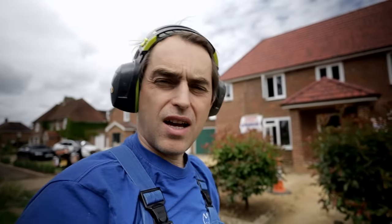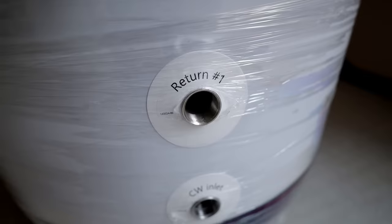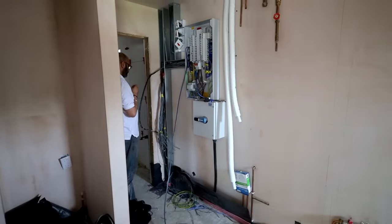We are back to Windsor today — another week and a half later — and the screed is done. We are ready to put the cylinder and heat pump in, however unfortunately we can't do that for two reasons: the cylinder return connection is cross-threaded, so this has to be sent back to Vaillant, and electricians are working in the plant room.